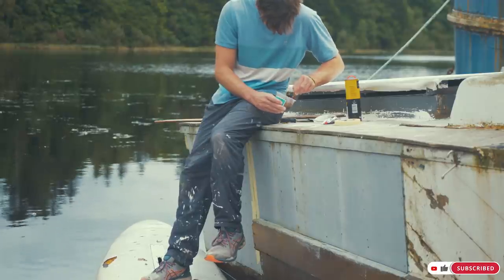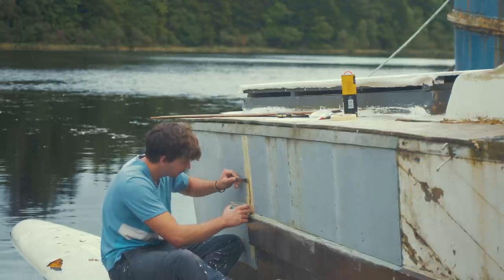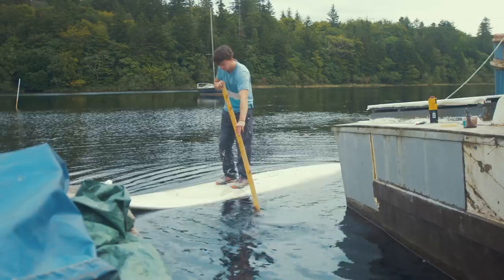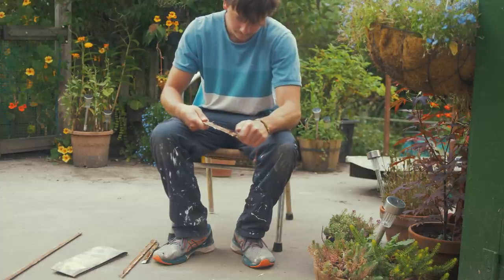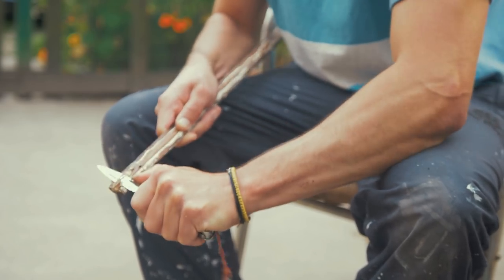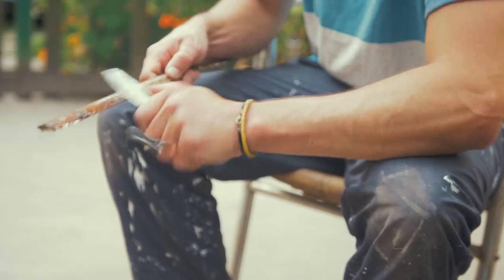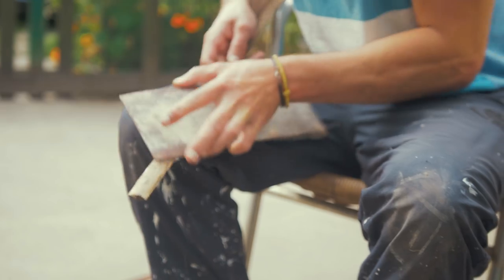So, getting back to the starboard stern, and this work has been long overdue. For anyone that might not be familiar with the work that was done here on the stern, we cut out a lot of rot. All this section that you can see here is in grey aluminium primer paint. This was originally double diagonal, of course, like the entire hull. It was all affected by dry rot. We cut it all out, and then we laminated up sheets of plywood, four sheets, to make it fit this space. And this was the quickest way to get this sealed up. You can see we cut so close to the waterline as well, so it was quite nerve-wracking work for sure.